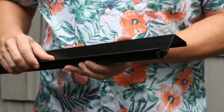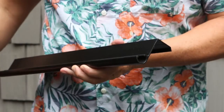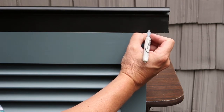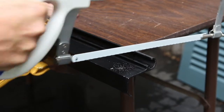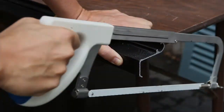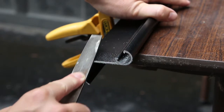Start by separating the L-shaped top hinge leaf from the lower, smaller bracket that will be used later. Align one end of the support hinge with the top left corner of the shutter. Then place a mark on the hinge just slightly beyond the right edge. Cut the hinge at that point with a fine-toothed hacksaw. Cutting the hinge may leave burrs and sharp edges, so file until smooth.